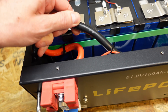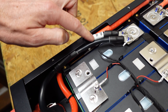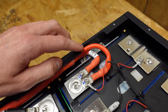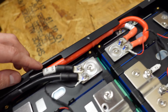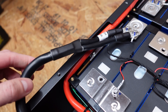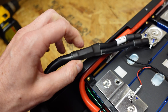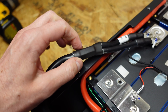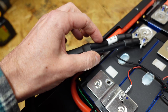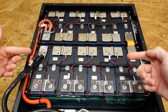Look at the size of these conductors — this is four gauge silicone insulated wiring, it's huge, almost the size of my index finger. It's interesting how the piece of four gauge splits off into two pieces for the ring terminals on both the negative and positive connections. There appears to be a hex-shaped clamp in there — probably just a butt splice with the number four going in one side and two smaller gauge wires coming out the other.